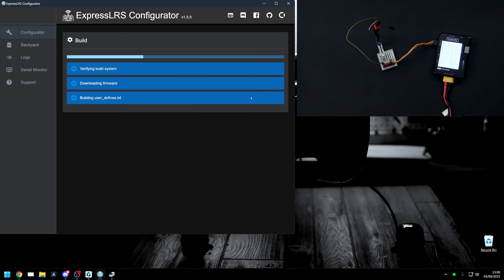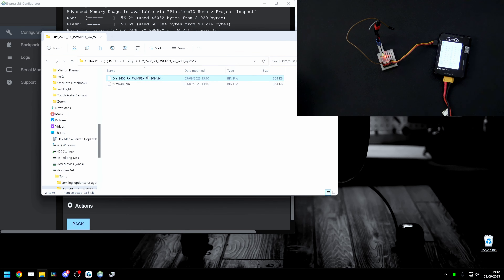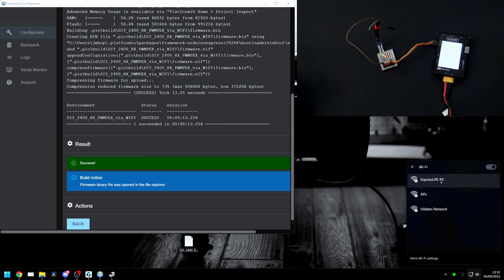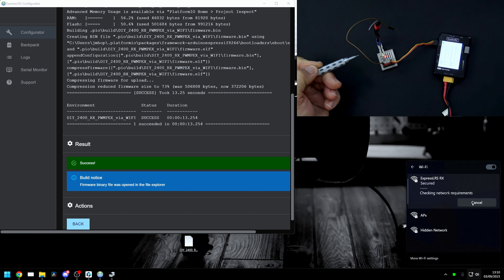After that, go down and hit the build button. If you've never built an ExpressLRS binary before, this will take some time. The binary has been built and you can see two options: one is the descriptive name of the binary and the other is just called firmware.bin. I like to use the descriptive one so I know what I've got and what I flashed. Put that on the desktop, then go to your network connections and connect to ExpressLRS in AP mode.